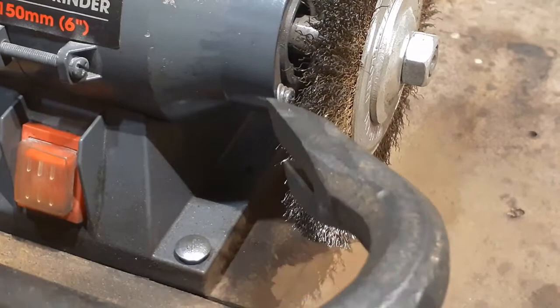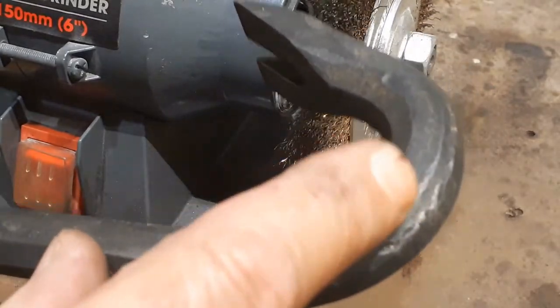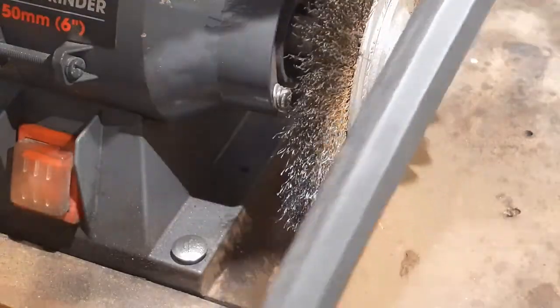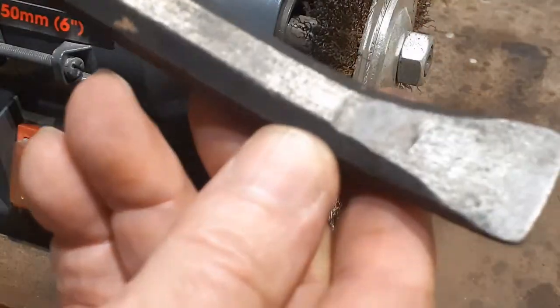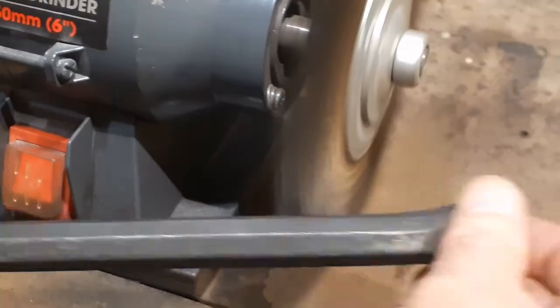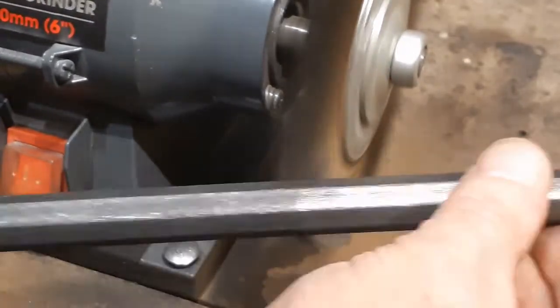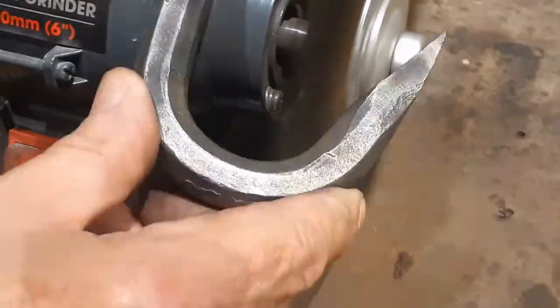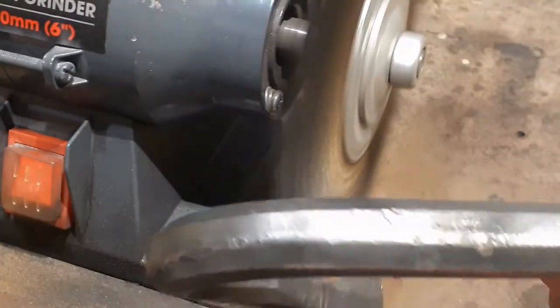You will notice that we have some pitting on the surface of the crowbar. It also looks like this crowbar may have previously been used as a hammer. The wire wheel will get us down to some bare metal. The filing will re-establish the flat surfaces. The flappy disc will smooth out the surface pitting. And the final filing will cut down any aggressive flappy disc marks.